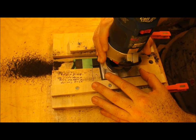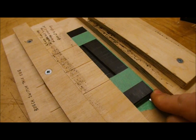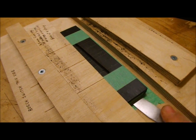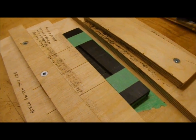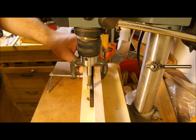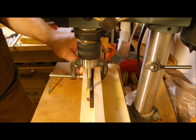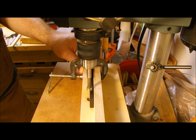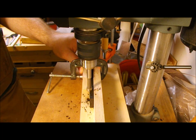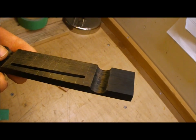Let the bit stop before you remove the router. To separate the two pieces I just get in there with a pallet knife and away you go. Over at the drill press I'm using a half inch Forstner bit to drill out the trough which separates the main body of the bridge from the wing. I've slowed down the speed and I'm progressing very slowly in the cut because this is ebony after all, and if I jam it down too fast it has a tendency to make the bit wander. And here's the result — a nice little channel.